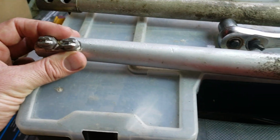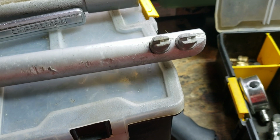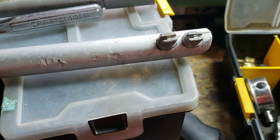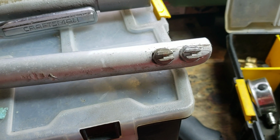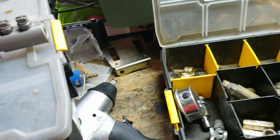This is for 8 gallons a minute. They're all 2502s, which is spec to get your maximum PSI, maximum flow on 8 gallons a minute. I don't feel like I get that, and I also run into a lot of issues where the 2502s will get clogged. I'm going to just make sure if any of these are clogged.